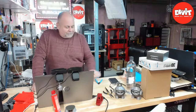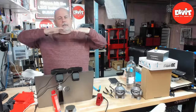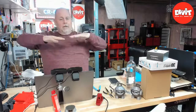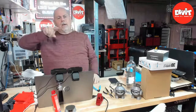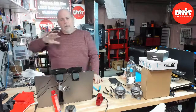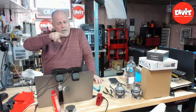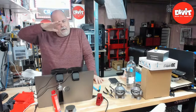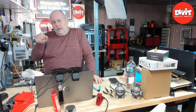Excellent. So yeah, as far as the sticking, sometimes when you think your Z height is right, maybe go down a little lower. When I first started, what I was reading and watching said you want it to feel like fishing line on the bed, but I find that I want to squish it a little more than that. But on that printer, you just want to make sure.